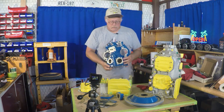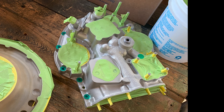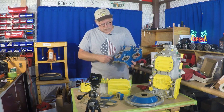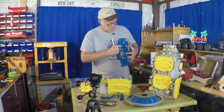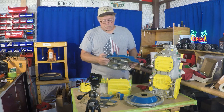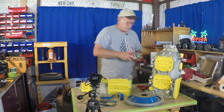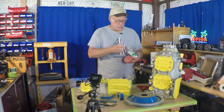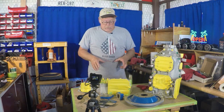This is kind of the more complex masking job you're going to have — the accessory case, because that's where all the accessories are. You can see we've got the fuel pump pad, two magneto pads, vacuum pad, governor pad, and all the attaching fastener positions have had paint kept off them. For various plumbing fittings I like to use PVC pipe plugs — you can use steel or brass ones from the hardware store, but I like PVC because they won't hurt the aluminum.